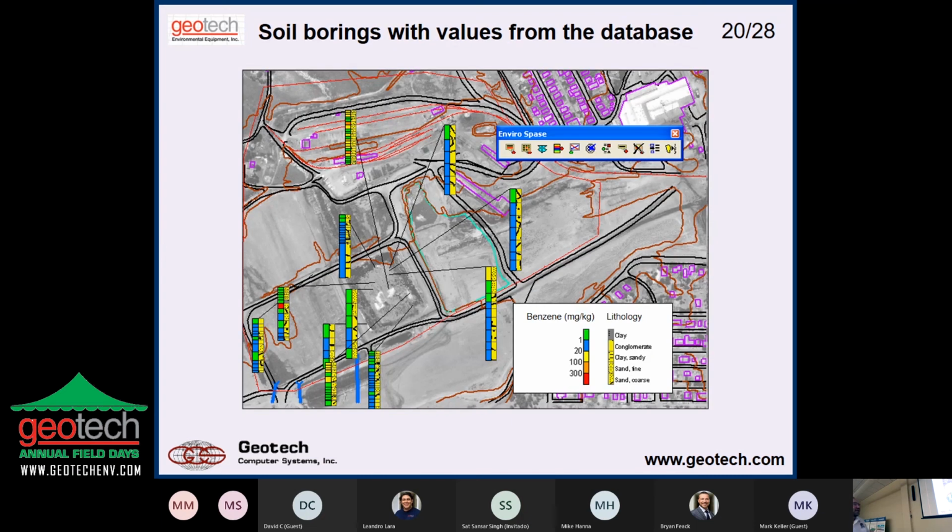Now, there's another example in GIS. They've chosen to show the contaminant concentration here in one track and the lithology in another track. And I worked on a project a while back where it's going to cost a lot of money to dig it all up and take it to Utah. And so we helped them make some displays like this, and they found out it was in glacial till, and they found out that all the high values were in the fines, silts and clays. So they bought industrial log washers, they washed the rocks, put it in the backfill, and set aside the silts and clays, and saved 90% of what they thought was going to be $1 billion. So they didn't give it to me, though. I don't understand. Should have.